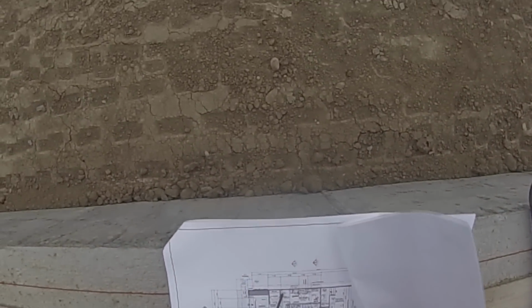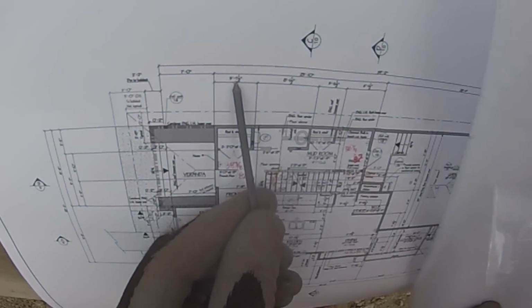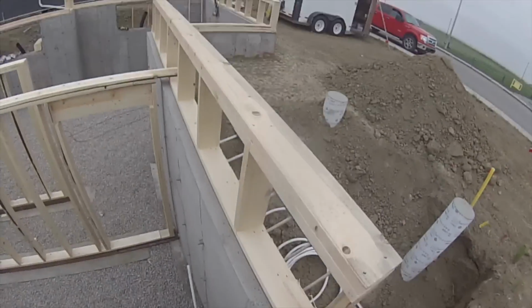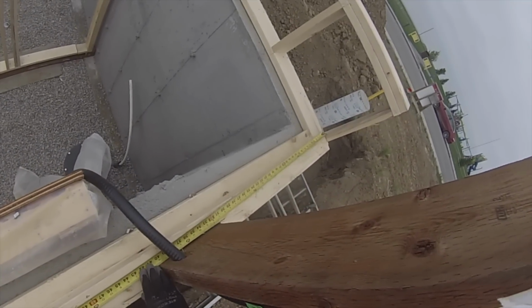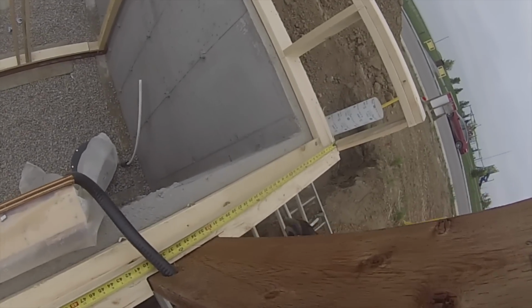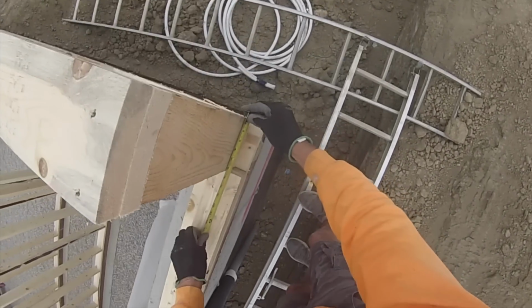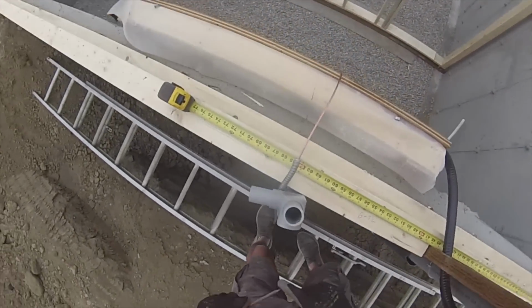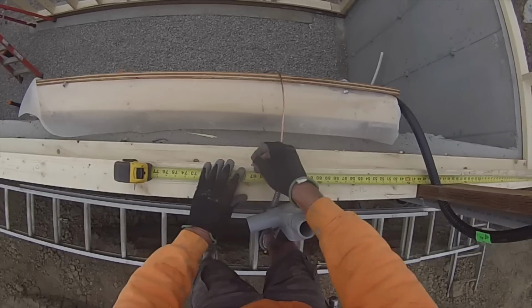The toilet is here. So on that front corner, I come 5'7.5" outside to outside. Okay, so 5'7.5" from the outside of the house to the outside of a 2x6 wall, and then the toilet. Outside of the building. Okay, so get this set up here. Side of a 2x6 plumbing wall, so we need to check that. And then, so this is where the 2x6 wall is,